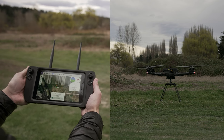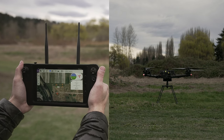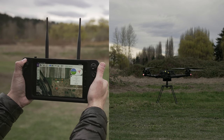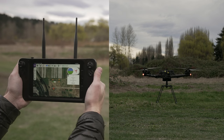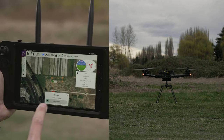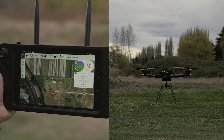One last important point is knowing how to do an emergency disarm of the aircraft should it be required. For that, I'm going to just arm the aircraft — arm — motors are running on the ground. You just click the armed button, the text on the screen presents a disarm command and we can slide that to disarm. So the emergency disarm function is available to you at any time, whether you're in flight or on the ground at idle. It's only to be used in an emergency where you didn't have any other option to disarm the aircraft.